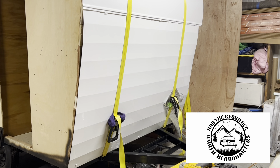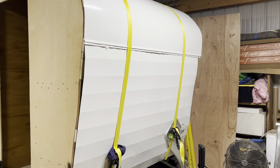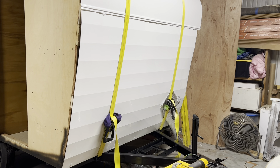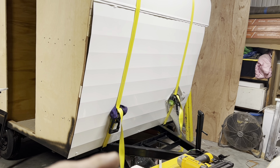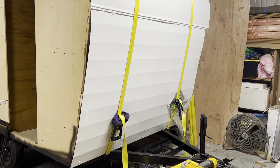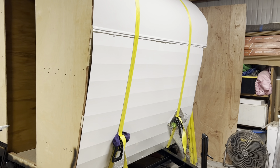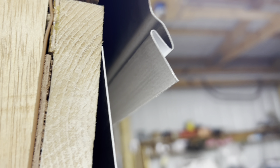I'll give you a little idea of how I do this. I've got that whole new front piece right there, and there's a hem at the bottom — it just curled under and snapped together to take the edge off and put a thick edge on there. So there's a hem on the bottom, and the top on the front is just flat because it's got to sit in this Pittsburgh seam.